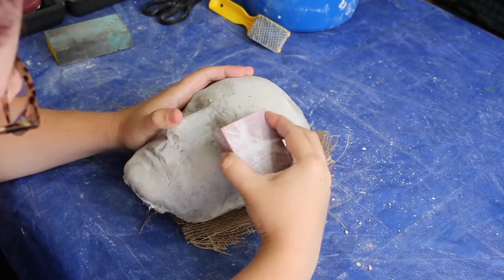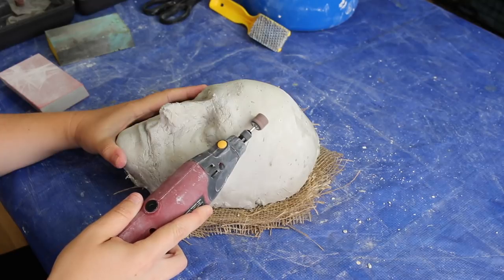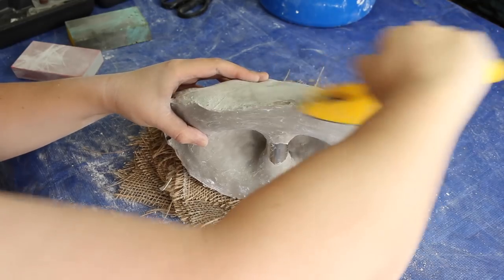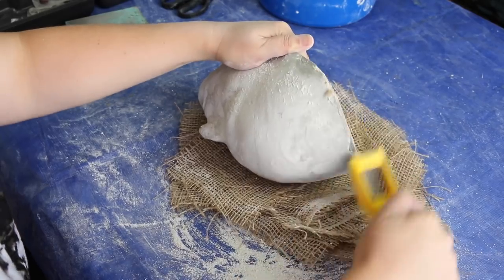As is the case most of the time, the positive is going to need some cleanup. I started by sanding off any little air bubbles of Ultra Cal, and for the bigger bits I used a rotary tool like the Dremel to sand those off. For the edges I used a rasp to sand off any sharpness. This is really important so that you don't cut your fingers while working with your positive.